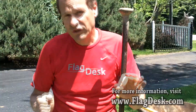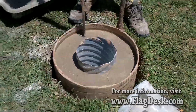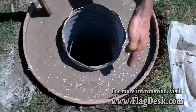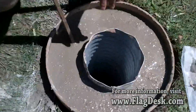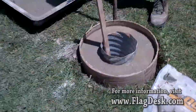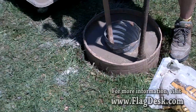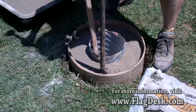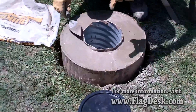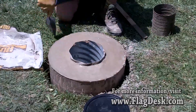I'm making sure there are no air bubbles and everything's centered up. The ground sleeve is perfect but the sonotube pedestal is slightly closer on one side by a little less than an inch. We can take our bar and move things around both inside and outside the sonotube to bring it into center. Then we use the trowel to finish it off, slope it up towards the ground sleeve with a little finishing cement. It's setting up nicely and we'll cut this cardboard sonotube away.